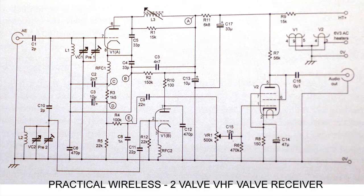Whilst anybody looking at this might say that two valves were used in the circuit, one of the valves used is actually two valves in a single envelope. The second physical valve, the EF91, was only included to boost the output to a level that will drive a small loudspeaker via a suitable matching transformer if required.